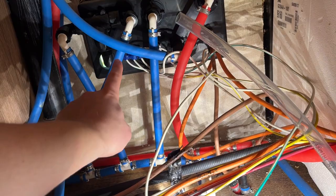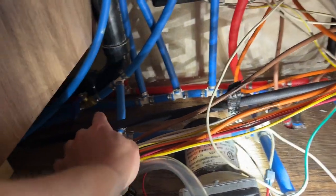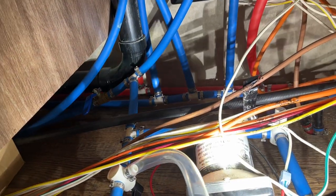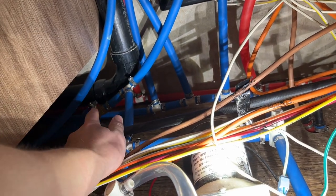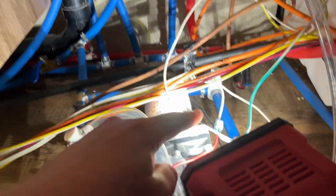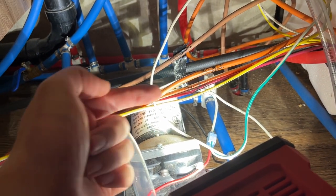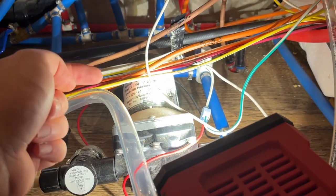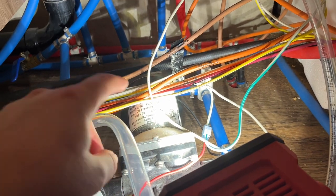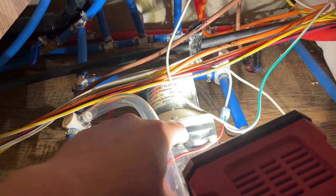The right one goes to my pump right here, and you can see where it splits off at a T to the pump. It also goes right to the tank for the tank fill. I put a shutoff valve there. The second issue you can have is your pump can actually start back-feeding. There's a check valve — basically a one-way valve — that prevents water from feeding back to the pump when it's off. That valve can also fail. This just unscrews from each side and the pump can be replaced for about $60–$90 on Amazon.